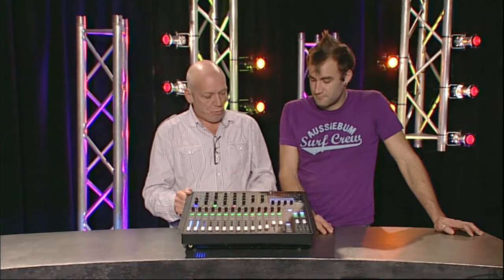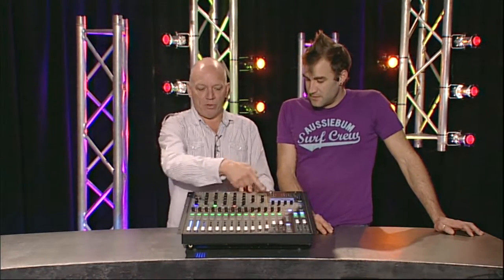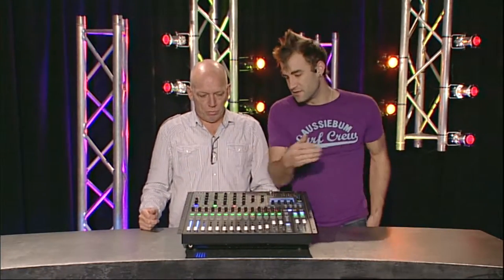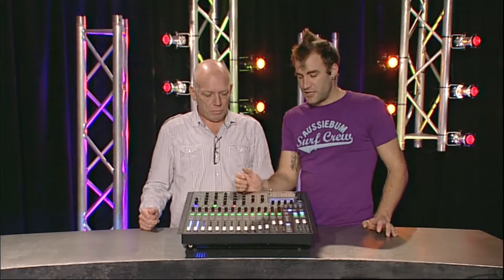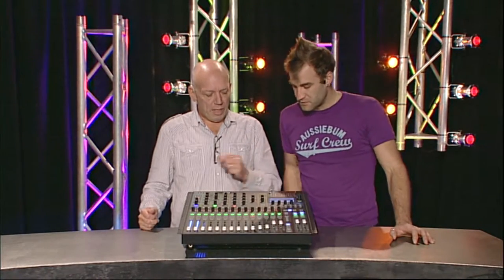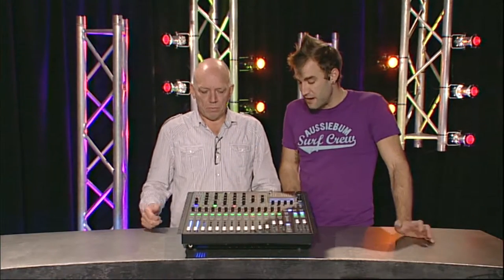James has run this unit up. We've got knobs for everything - every channel has adjustable gain, high pass, gate, compressor, 4-band EQ of which two are full parametric, and a delay. There's delay on both inputs and outputs.